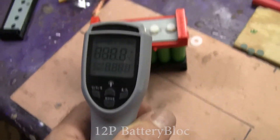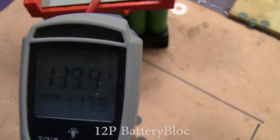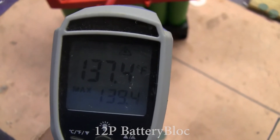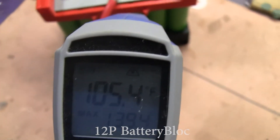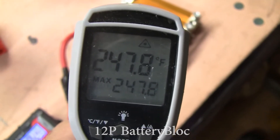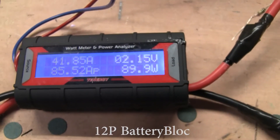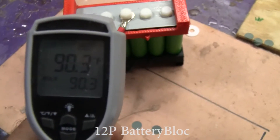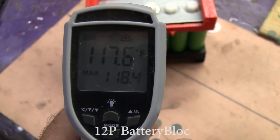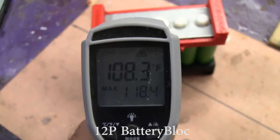Let's check the temperatures: 103, 104 degrees. And the cells? 139, 130 degrees. So these cells are heating up, but the battery blocks are cooler than the cells — the battery blocks are not adding any resistance. All the heat is coming from the cells. Over at the resistors, where the work is being done, we're seeing nearly 250 degrees. We're still drawing 42, 41 amps. The battery blocks are easily able to handle high current — it could handle much more than this. We're still within reasonable running temperatures, even though we're running pretty close to a dead short. Still around 100 degrees — this is Fahrenheit, by the way.